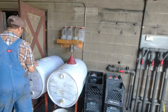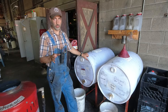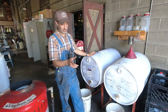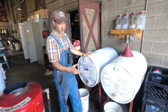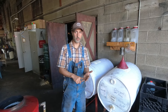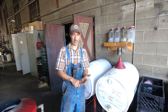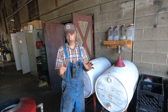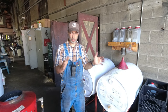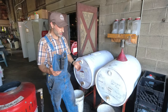On top of that, every single day at the end of the day we do a chemical analysis of the boiler. The fireman will take a small cup, get a sample of the boiler water by opening one of the glasses — we have a line tapped into the drain — and put it on the water testing bench. The following morning we do a chemical analysis, checking for TDS (total dissolved solids), polymers, pH, alkalinity, and sulfites. We have our own target range, and depending on where the numbers fall, we adjust how much or how little treatment we use.